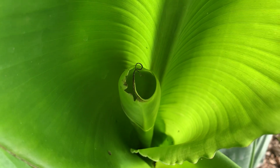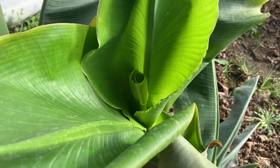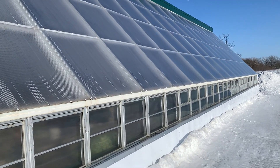Greenhouses are a little bit different because plants want full sun, so we have to deal with a little extra heat loss from over-glazing. It's fully glazed because we're growing plants in here, and plants want as much sunlight as possible, especially on the short days. We also don't have an overhang on the outside — this isn't designed like a passive solar house, because we're going to use the greenhouse in the summertime as well. In the summertime the greenhouse is opened up to the outside, whereas in a passive solar house it's not.